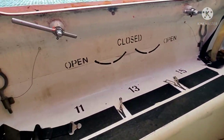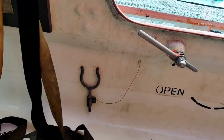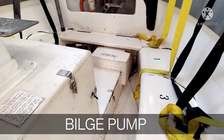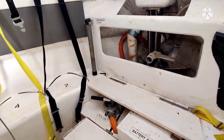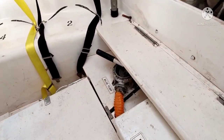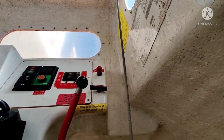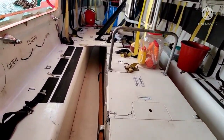The crutches should be attached to the boat — this is very important. Another item you must have is the bilge pump. You should also have two painters: the forward painter should be attached to an arrangement that can be released from inside the lifeboat. The release arrangement is here — you can see the red knob. Pull it and the forward painter can be released. I'll go outside to show you the painters.